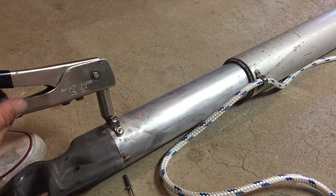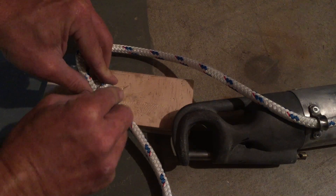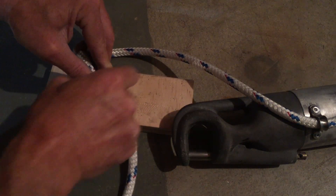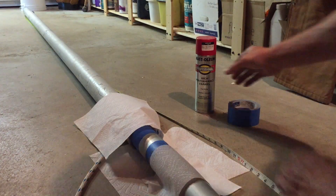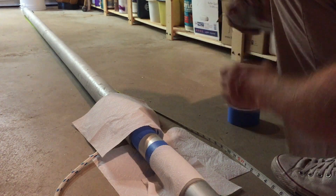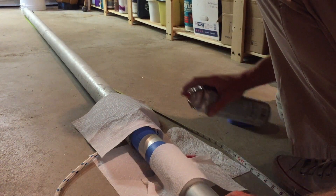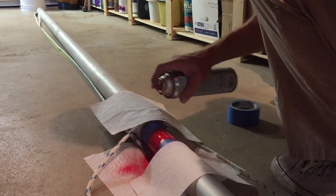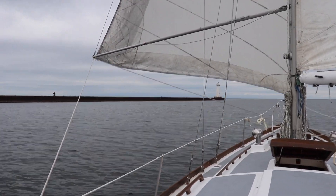Now we can see the alignment of the cleat with the control line, and it's cleated off. Now for the other end cap, we'll rivet that into place. All that's left is to cut the control line to the right length — I leave a little bit extra to do a cleat hitch around the cleat. Since I shortened my whisker pole, I decided to take one more step and paint a red line as a signal not to extend the pole any further — I wouldn't want to risk overextending the pole and having it buckle under load. Thanks for watching — please let me know if you have any questions or comments, just put them below and I'll get back to you.